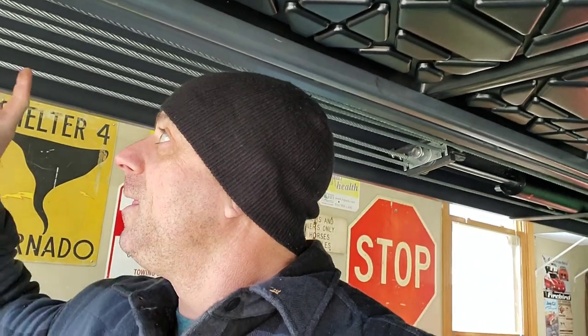Another maintenance item is the cables — you should be maintaining your cables as well. I walked up and down the cables lightly running my fingers across them trying to find any burrs. Pay attention while doing that and use your eyes. If you get burrs, that's a problem. If you have around 10 or so burrs in a one-foot range, it's time to swap out the whole cable — but don't quote me on that number, look it up to confirm.